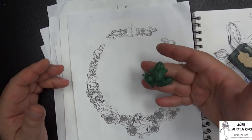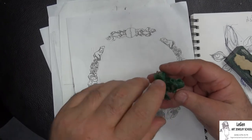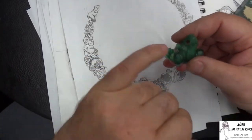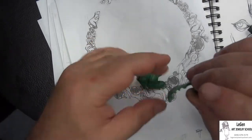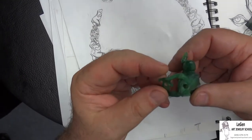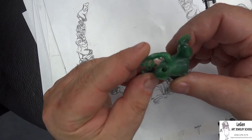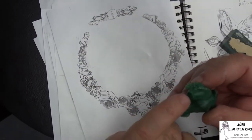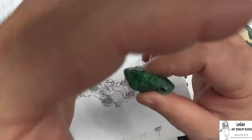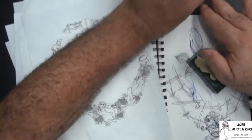Then I slowly start adding details. You can see that it is empty inside — I carved everything from the inside to make it lighter. To get inside, I cut off its front legs, which are also empty. When I start casting, they will be coming back. The same thing I did with its knees, here and there. I also drilled a hole all the way through to empty it out more. And here it is sitting perfectly on that necklace.